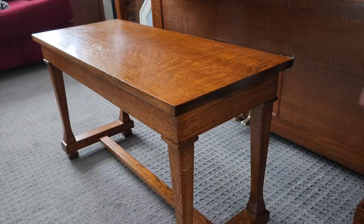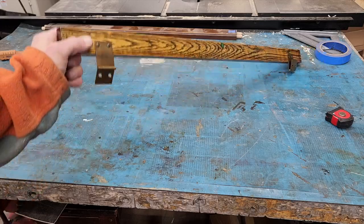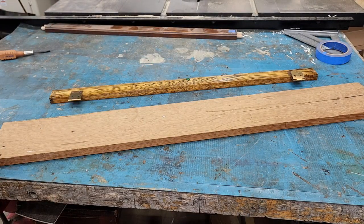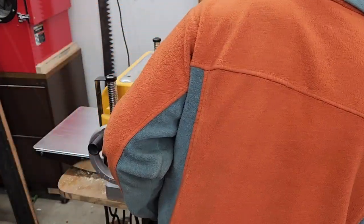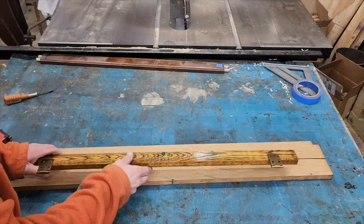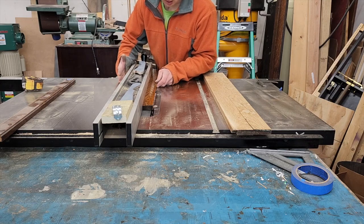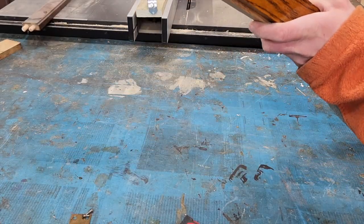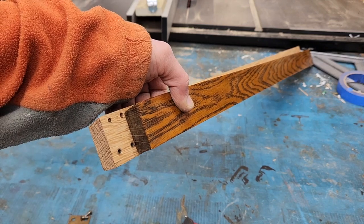For our project bench today, I'll copy this simple folding angled rail out of this Tonk bench. A friend was recently doing some remodeling on his old house and found this piece of quarter-sawn oak in the walls. I think there's just enough here to make a duplicate rail out of. First I'll take down the thickness. One thing I really like about this planer is it doubles as a metal detector — metal detected, which means I can only get this board out of this area right here. I got pretty lucky. I'm not really measuring at all. These holes, probably from some old lock, are right where my cut's going to be, so I got lucky.